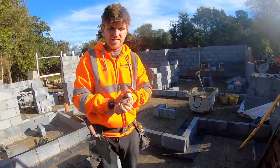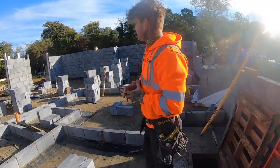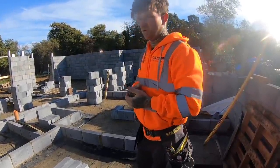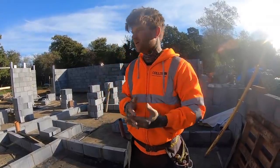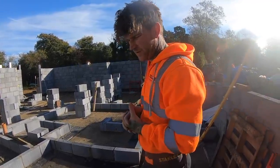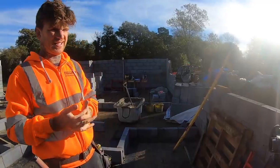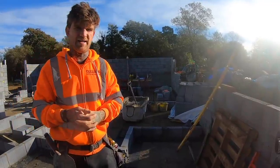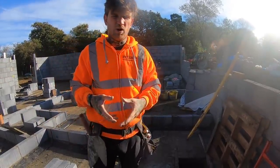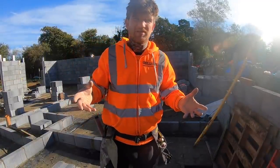Rolling. Right, all the internals are set out. Because I'm going to do corners, can't really help do any more block work until I've got a few corners up. And these corners are big corners. There's a lot of bricks in them. Tom's just getting some bricks over for me now, some half bricks and some bricks. I like doing corners. Obviously, it's not as quick as all of you running in, but it's very stress-free for me because I'm just in one spot. It's quite enjoyable for me to build corners, but you just don't make as much. Let's go build some corners.